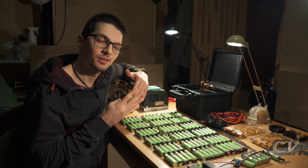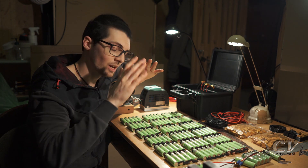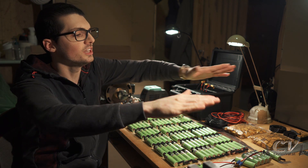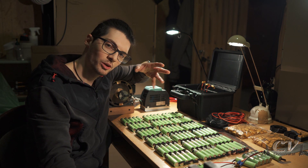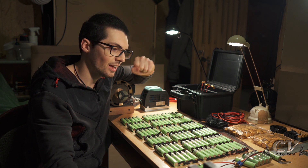And 4S for a 12 volt configuration will give you 3X, 4X, maybe even 5X of the cycles. 7S at 24 volts — there's no debate between 6S vs 7S vs 8S; 7S is just it, it's perfect. But there is a drawback: 24 volt sine inverters, for example, are more costly, and yeah, I don't like that.